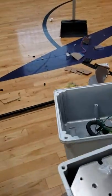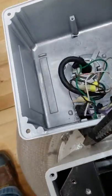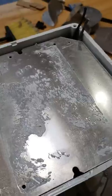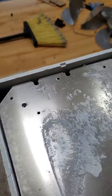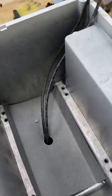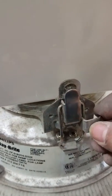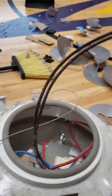Remove the ballast completely and cut the remaining wires. After you remove the ballast, remove the screws that open up the inside. Then unbuckle the latch — loosen the screw to release it, open it up, and once you cut that wire, you can easily remove the top part out of the way.